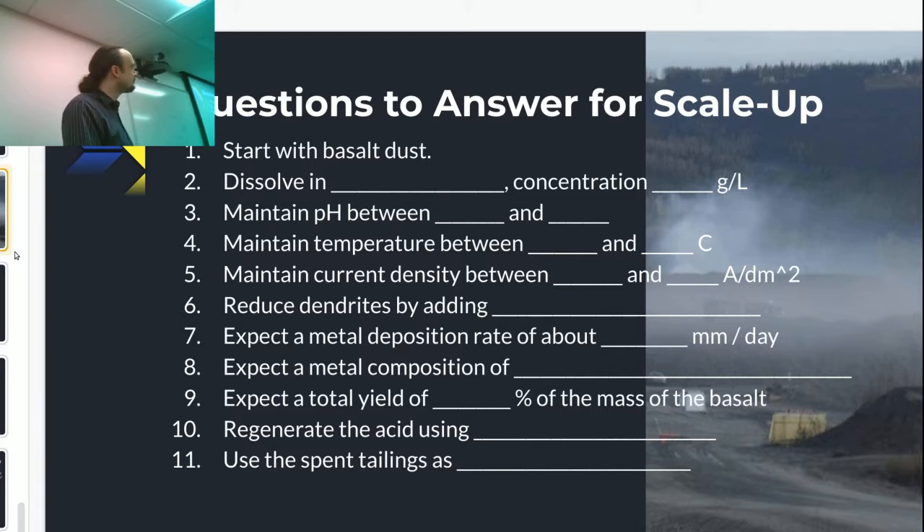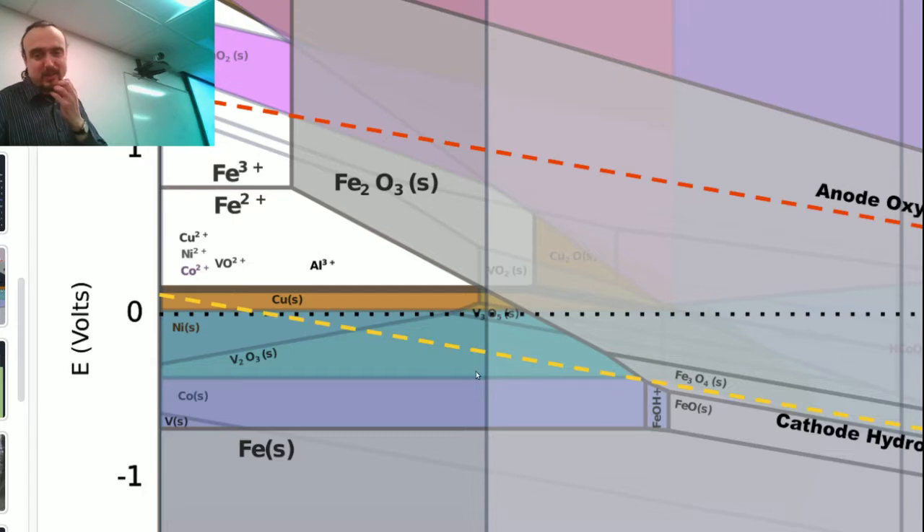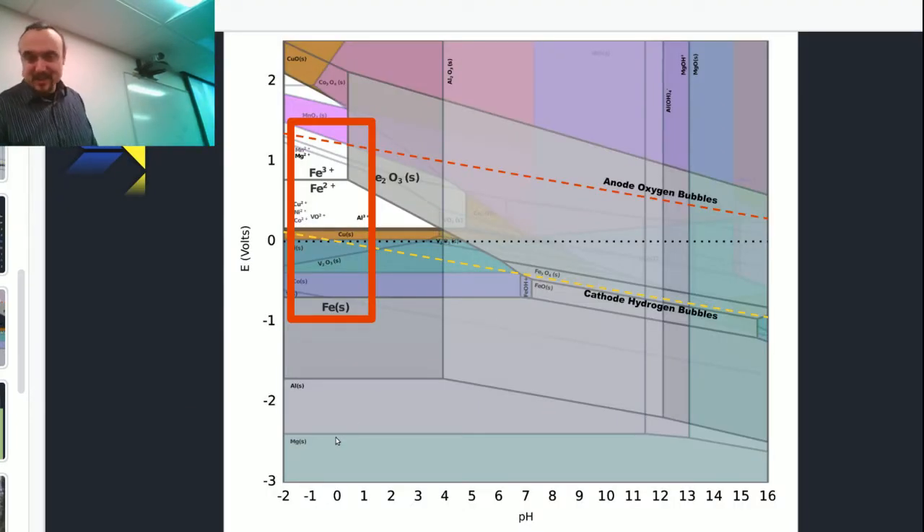The main thing is you would probably want to keep the voltage controlled. Long-term, water is probably not the right material to use. In particular, picking a solvent that has no hydrogen could conceivably allow us to go all the way down to this region — electrodepositing aluminum. MIT has been working on a sort of chloride electrolysis where they're able to deposit aluminum, and it's because there's no hydrogen — it's just a different solvent. Conceivably you could still have the sulfate as one of the ions there. There are a ton of ionic liquids, though a lot of them tend to be high temperature or kind of reactive. Kind of reactive is actually good when we're trying to tear apart rocks — conceivably that's a feature.